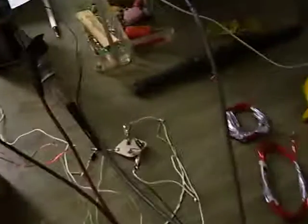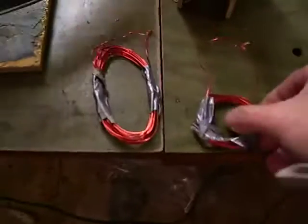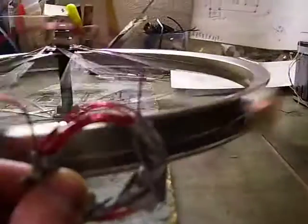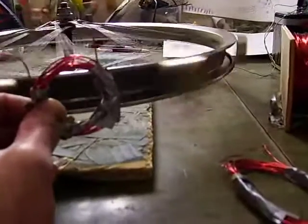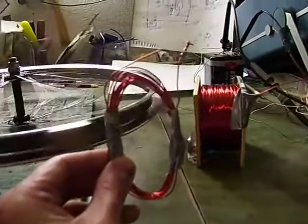The scope is showing that I'm at the level at which the transistor is turning on and off, so it will automatically push this coil. Now, what good is that? That's where these coils come in. This one is a small coil, same number of turns as that one, but when you move it close to the wheel and it's shorted out, it causes drag towards the magnets — in other words, it slows down the wheel because it draws full current. We don't want that when creating voltage for a generator, so we use this other coil instead.